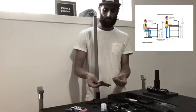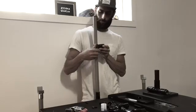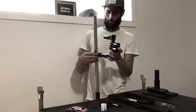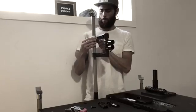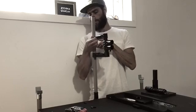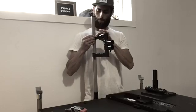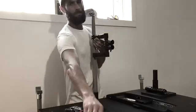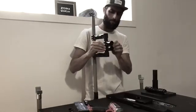So let's put it all together. Reference the ergonomic chart to install at optimal height. When installing an HJ12 joint set, you will be using an AP hinge to clip onto the tube. It's important not to over-tighten or under-tighten the HJ12. For a small job like this, it's easy to use the 5mm key for all of the installation, but you can also opt for a drill with a 5mm bit.